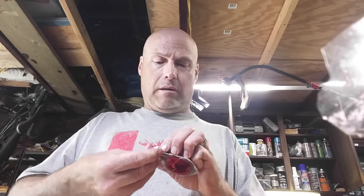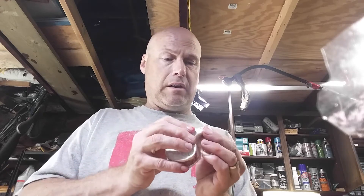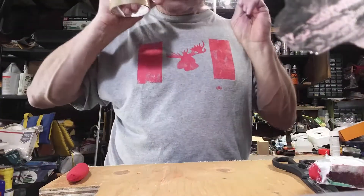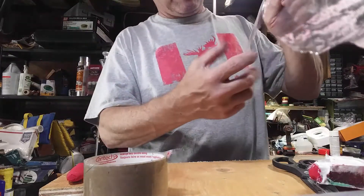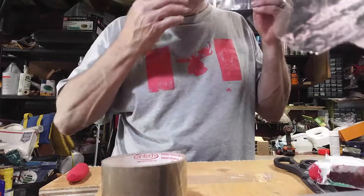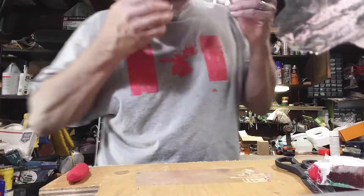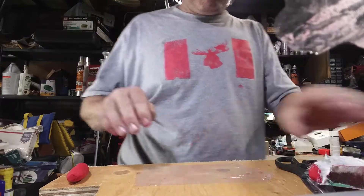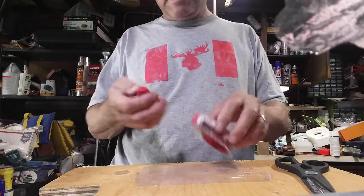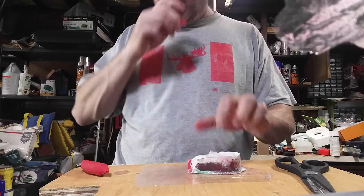Give it a quick sand and we can just build up the outside — there's a little trick. I'm going to cast on top of that. I'm going to put down some packing tape as my base, and I won't have to worry about fiberglass all over this piece of wood. Put that there, build my little walls around it with this stuff, and then we'll pour thickened fiberglass around it.